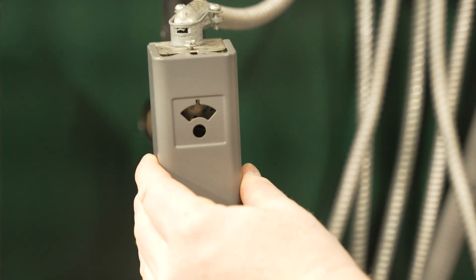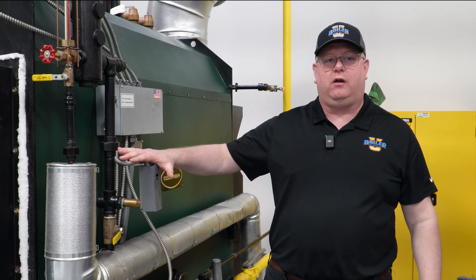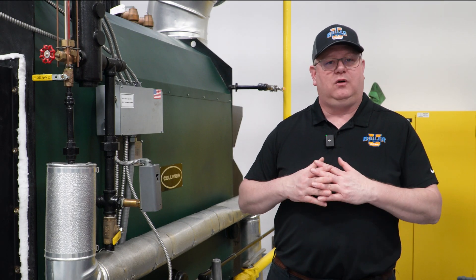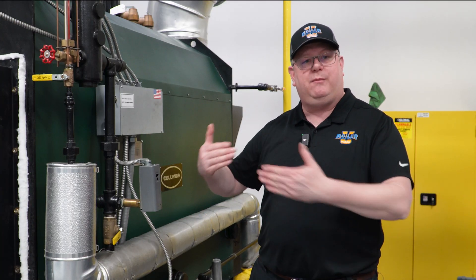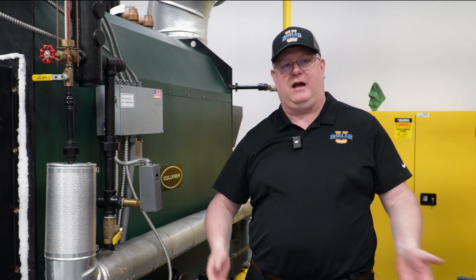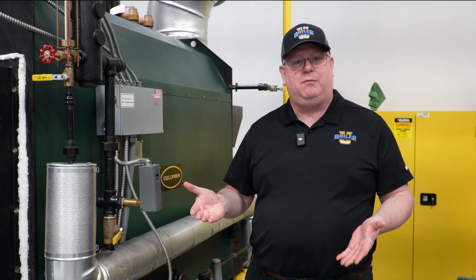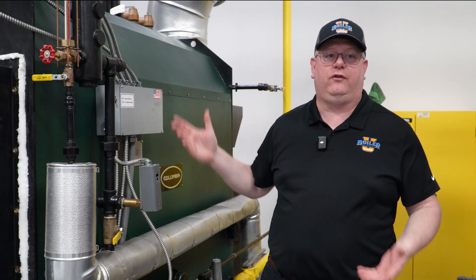So it will run, but it won't theoretically generate steam. We're just going to keep that boiler at a minimum temperature — 160, 170 — so that when we bring it back on Monday, we're not going from ambient temperature back to operating temperature. It's a much smaller change, and of course that's going to reduce stress on the unit.